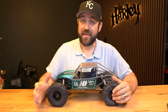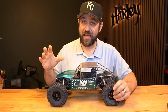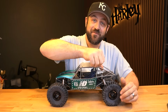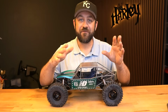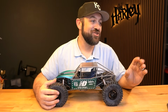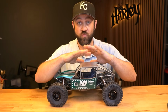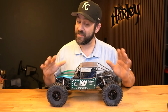Then you are going to want some PLA filament, specifically PLA. Don't try and go with a different filament because you think it might be a better choice. PLA is the way to go because when you're welding or even brazing, you're going to get it hot and it's probably going to melt. Now, PLA you can just push it off, flick it off. If you have to use a little bit of force, it's very light. It's just a soft enough material that it comes right off and cleans up easily. I've seen a number of other people try and print it in PETG or higher temp or higher strength materials, and basically it'll still melt and then it just is really hard to get off the tubing. So just use regular PLA. Cheap, regular Hatchbox PLA works fantastic. Just trust me, keep it simple.